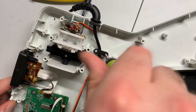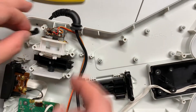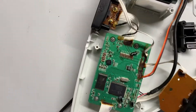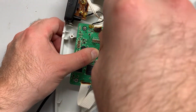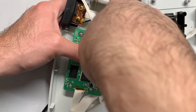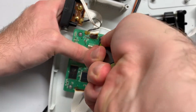Next, we'll remove this plastic bracket to release the USB and whammy cables. Save this bracket, because we'll need it later. Next, we'll undo the four screws on the main board so we can replace it with our breakout board for the start, select, home button inputs. Notice how the top two screws on my board are already a bit stripped, which means we'll need to be careful and work slowly to remove them. You want to push down on the screwdriver while turning and unscrew slowly. If you move too fast, you can strip the screw even further. All of these screws are going to be replaced, so it's okay to cut or damage them to get them out if it gets to that point. Just make sure you don't break the plastic standoffs that they're screwed into.